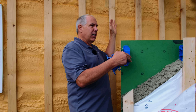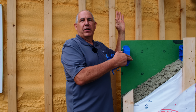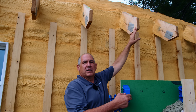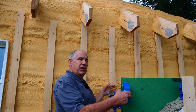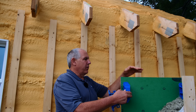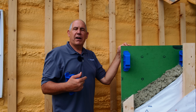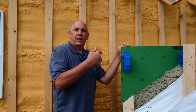The only thing you have to do is tear out the roof boards from the overhang down, but you leave the tails in place. We don't want to cut all the tails off — what we want is to be able to put this extra piece, what we call a raised tail, for the trusses. We want to do the same thing on those rafters and raise it up so you can put your normal soffit on. That allows you to have ventilation all the way from the bottom of the wall all the way up over the top, so you've got a perfect cross-ventilated roof where the air can go both directions. For those of you doing hip roofs, you still have ventilation, and you eliminate the furring strips that go bi-directional in order to get that airflow.